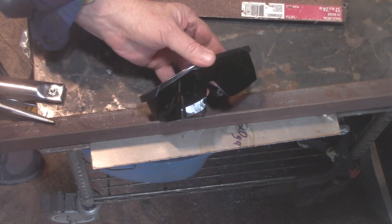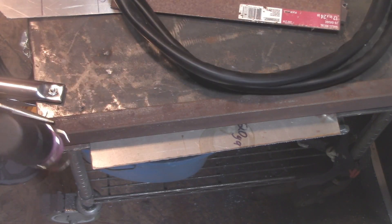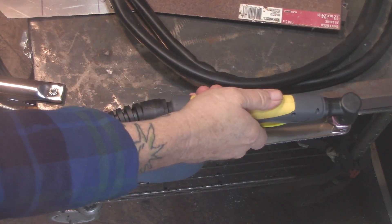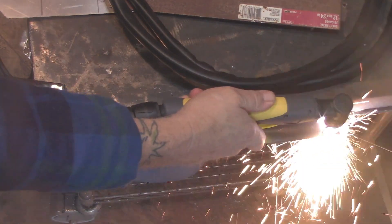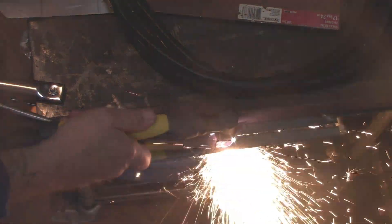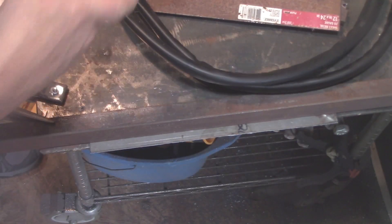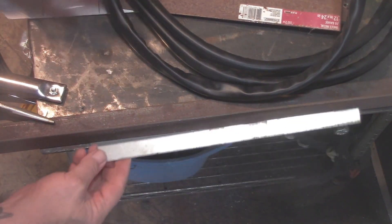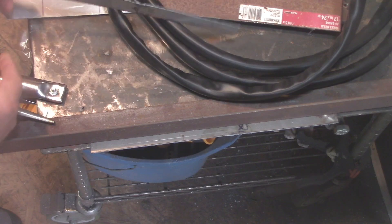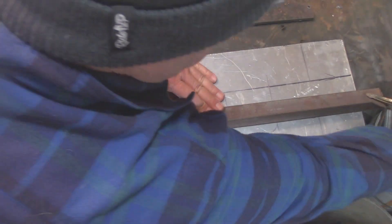Now let's cut some 20 gauge steel. If you're going to be looking at the bright light, you need eye protection — minimum shade 5 welding glasses; I'll leave a link below. I've got the machine set at about 20 amps and 30 PSI of air. Check your manual — they've got guidelines. If you have a smaller air compressor, you may want to lower your air settings so you're not burning through air too fast.